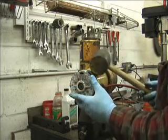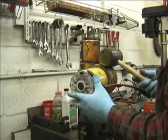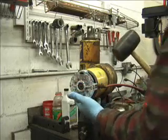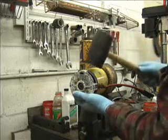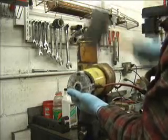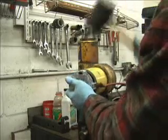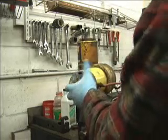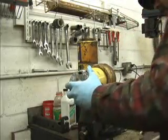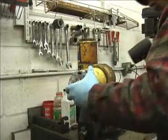So, this is how we try to get it off, and we work our way up from here, but this is just a large rubber mallet. Sometimes they come, usually they don't. Usually we get the case off and the armature is sticking out of the base of the motor, and we'll see. But these motors are pretty heavy, so you want to support it even though you're smacking it. And believe me when I tell you, I'm giving it a pretty good smack. I'm always afraid I'm going to crack a base when I'm doing this, but there really isn't much other way to get it off.